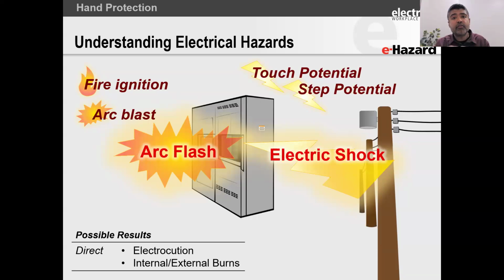So when you get that arc flash occurring inside equipment, think about this. That equipment's not going to be able to handle that energy. So you're going to have that equipment building up pressure. You're going to have that equipment catastrophically failing. You're going to get molten metal splash. You're going to get infrared radiation. We're talking thousands of degrees Fahrenheit here, and I can convert that very easily. It's also thousands of degrees Celsius. It's good to be exact on some of these things.